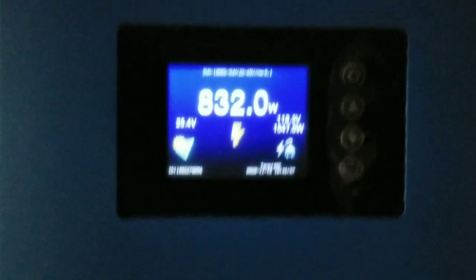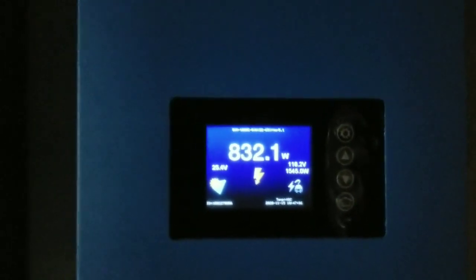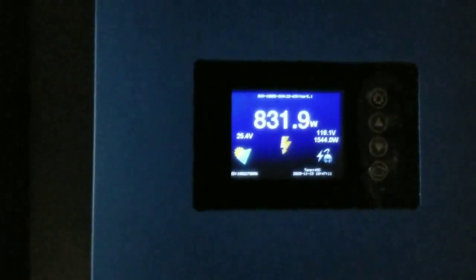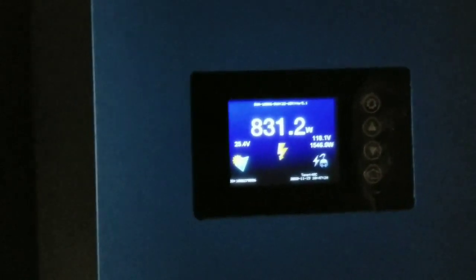I have to show you this — it's interesting. The batteries are getting low at 27%. Since everything is hooked up to the same line — line one or line two — what happened when I activated charging is the house is pulling 1,600 watts to charge the batteries. The grid-side inverter is trying to reverse the power back instead of buying that much, recycling the power from the battery bank back to the grid, reducing the amount purchased.